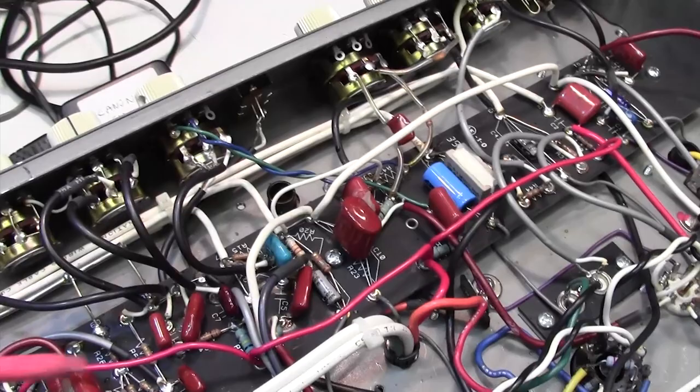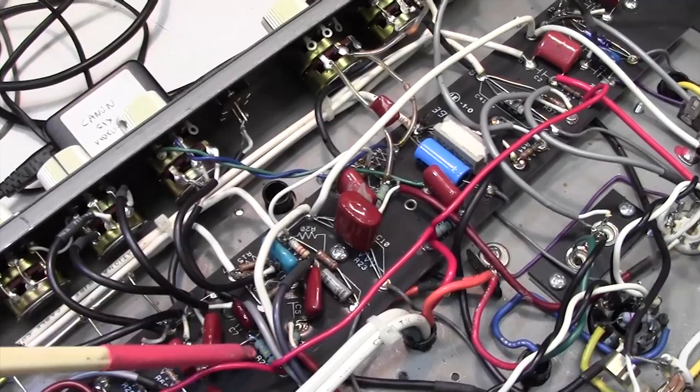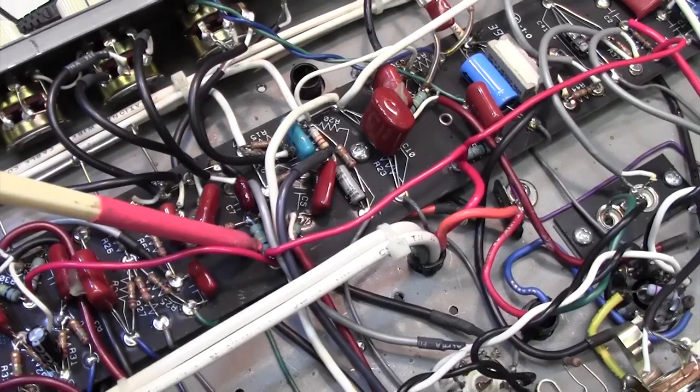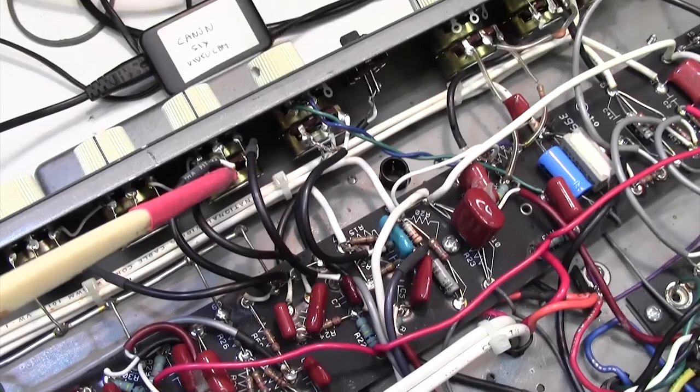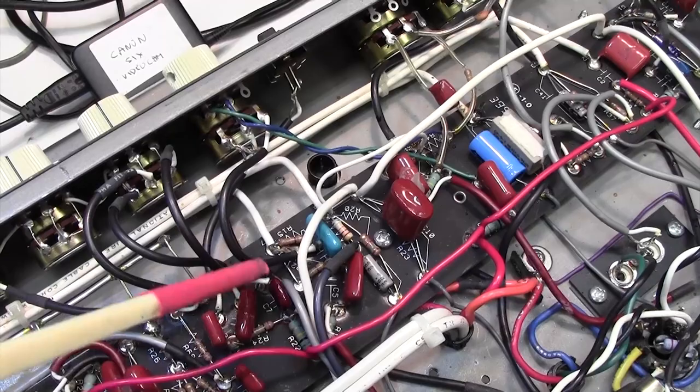we are looking at that capacitor there. That is the one that connects the output of the tone control circuit. There's the 100K resistor that sits in the anode of the tone control valve, which is removed at the moment. Hence, that side's at 400 volts or something. This side goes off to the treble pot, look. And, of course, that should be at 0 volts, because the capacitor should block the DC. However, it's at 4 or 5 volts.